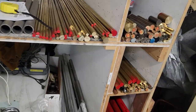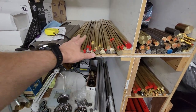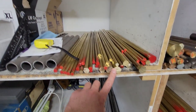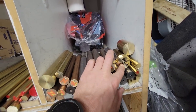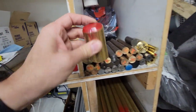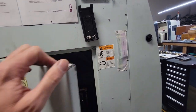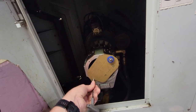We have to organize all those collets, and the stock I'm cutting this week or month typically ends up close to the lathe. Right now I'm running all this material in the month of June. The one-inch stock is this piece right here — some of it is smaller and some much bigger. Now that piece is actually two inches bigger than the collets. Here's a one-and-a-half-inch piece and you can see it's massive compared to the one-inch. And we have to put a spindle liner in every single time we load one of these stocks.